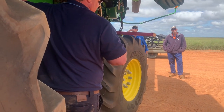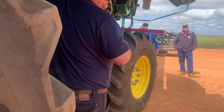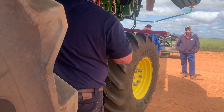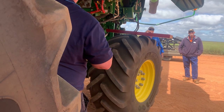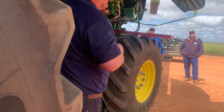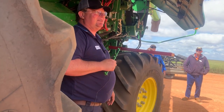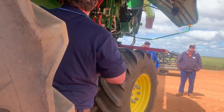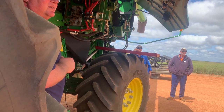Everyone said to me, well, you're going to overload your sieves by opening it up here. But if you go to your John Deere parts manual, you can actually buy a tough crop separation grate. You can buy 16 grates to put in there. It's a fair bit of money, probably about 20 grand in today's terms to replace it. So for me, the cheaper option was just to cut it out to make it bigger.